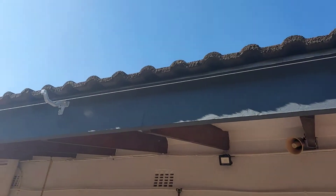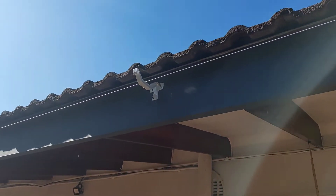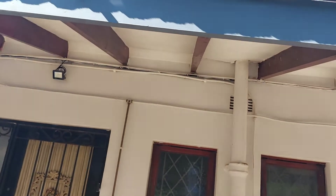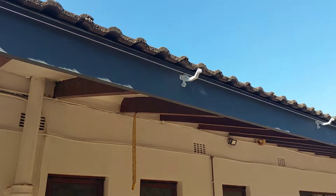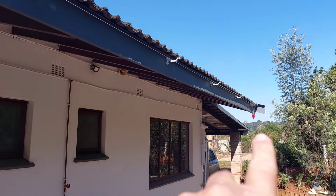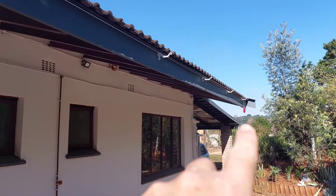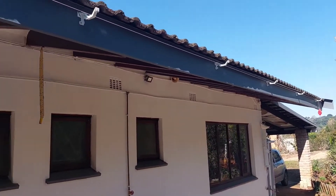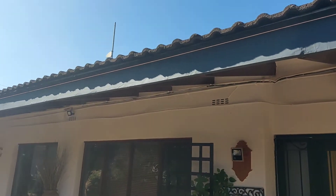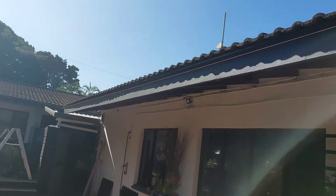There are going to be about 12 brackets in total. I've decided to keep the spacing to about 1.5 meters. Ultimately it's determined by where your outlet is going to be — in my case the outlet is on that side, which is why it's 20 millimeters lower. From there, you simply install the remaining brackets at 1.5-meter intervals.